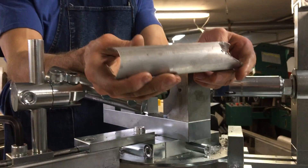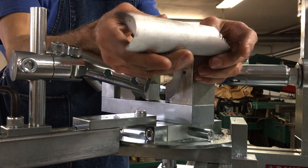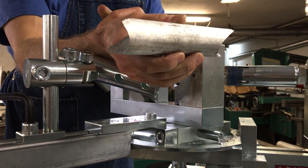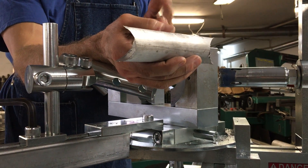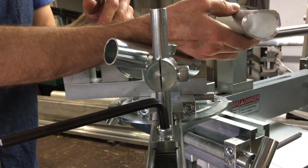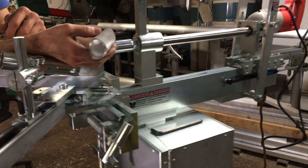With this now completed — a 38-degree angle on both ends, out of plane — that could be a common cut for anyone doing tubes, tube chassis cars. We've just demonstrated that if you needed to repeat that, you could do that very easily. It's very repeatable. And if you needed to do a right side and a left side, it's just a matter of re-indexing the indexable stop. Very simple. Very repeatable. Very fast. Done with Custom Fabricating Solutions' modular tubing notcher system. Thank you very much.